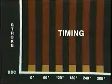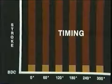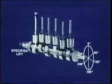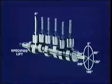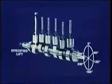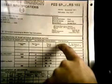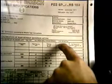Phasing, sometimes called internal pump timing, means setting port closure of each pumping element to equal intervals. Starting with zero degrees you've set for number one, you want the specified lift to port closure of each plunger to happen at equal intervals, at equal angles of camshaft rotation. With number one shimmed to port close at the specified lift, you may be changing shims on others for port closure at equal intervals. Check your spec for the firing order — you may think you remember, but not all sixes fire alike.